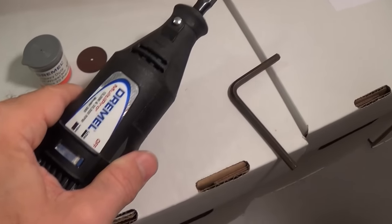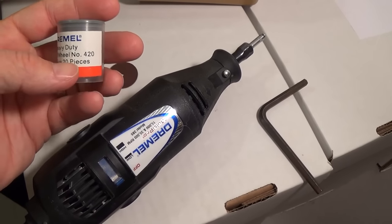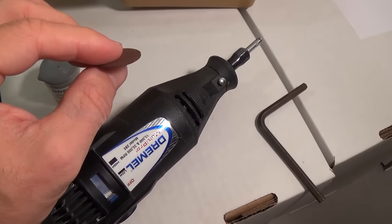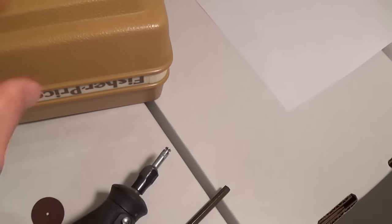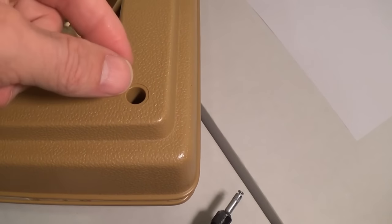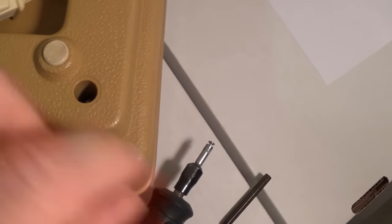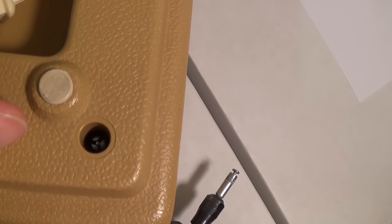What I'm going to use is just my Dremel tool with some heavy-duty cut-off wheels — these are number 420. I can use the edge to carve in the shape at the tip of my hex wrench. Beforehand, if you have a screw that's exposed, you might take some putty or clay and press it in to get an impression. This one's kind of deep, so I'll just try to eye in the shape on the tip of my hex wrench and see if I can get it approximately the same shape.